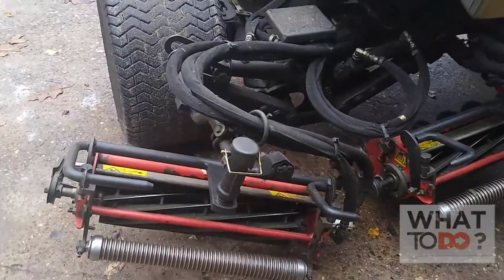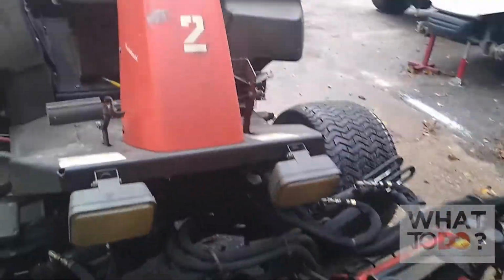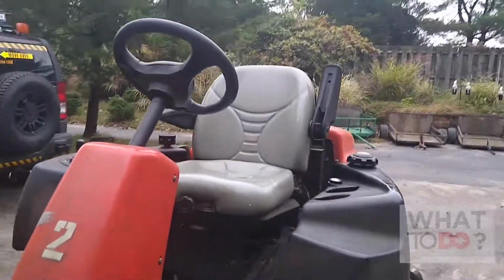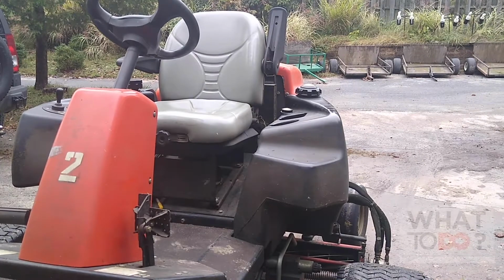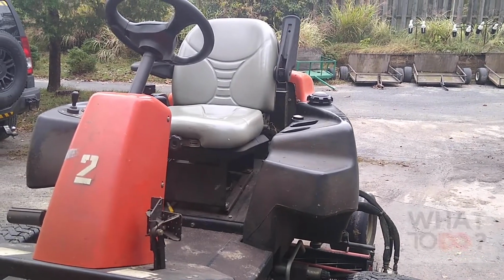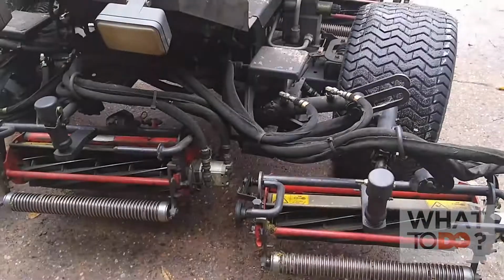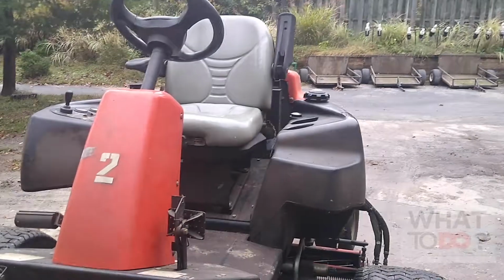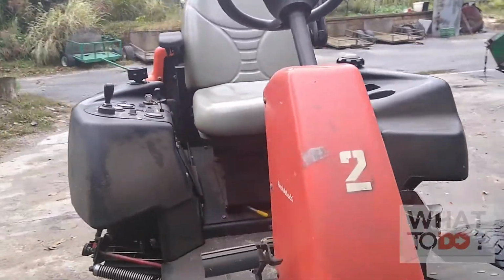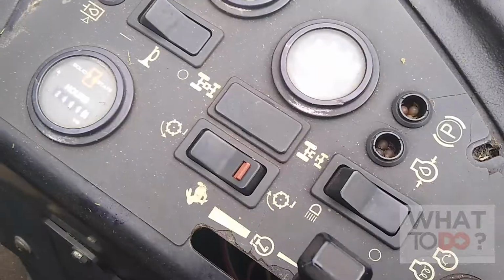We're going to fire this thing up, get those wheels engaged. Now, if you do have a machine that has the shutoff on the seat, you're going to have one or two options. Either A, somebody's got to sit on there the whole time while you do it, or B, which is never recommended, but disconnect the safety switch on the seat to do this. Again, that's not recommended, but this is what I do. It's a safety issue when you do that, and always remember to hook it back up. All right, let's get to the backlapping.